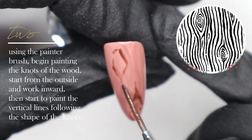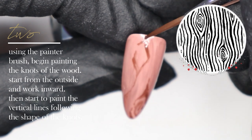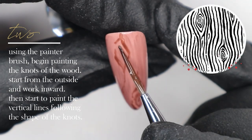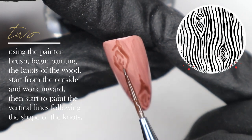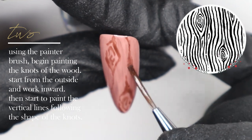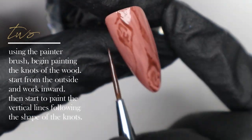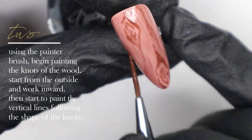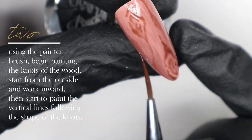You can see the picture in the upper right corner — that's a picture I got off Google that I'm using for some inspiration, loosely following the design there. It's actually just a wood grain stencil I googled, so Google is your best friend sometimes for reference photos. Using the painter brush here, I'm applying heavy and light pressure in areas, and this adds variation to the veining and the wood grain that we're creating.